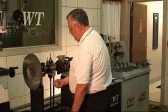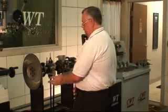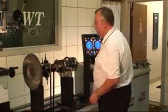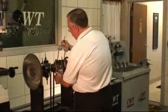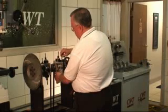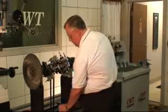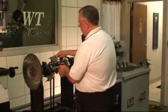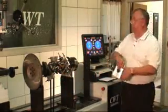I'll simply tell you that quick nuts are very attractive at this stage of the game, but I want you to be very careful with that thought because it is a safety issue, and there is no remedy for that kind of event in the event of a technician getting hurt. Trust me, the law will not work to your advantage because you put those on there. For the few minutes that you're going to add to the entire job of screwing these nuts on, it's a safety issue that should not be violated.